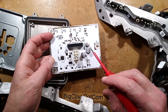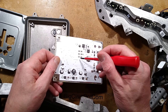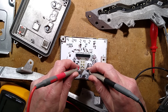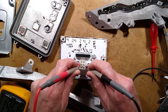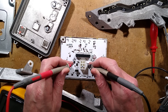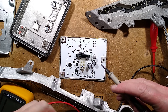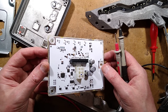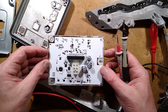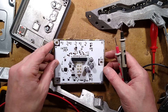Those two connector pins are common, two may be for power supply positive or negative, and then the other two are likely data — maybe CAN bus. So we have positive, negative, and CAN bus, which is very much what we get in modern vehicles. Interesting — are they using CAN or a proprietary protocol? It would make sense to use the industry-standard CAN bus for component availability.